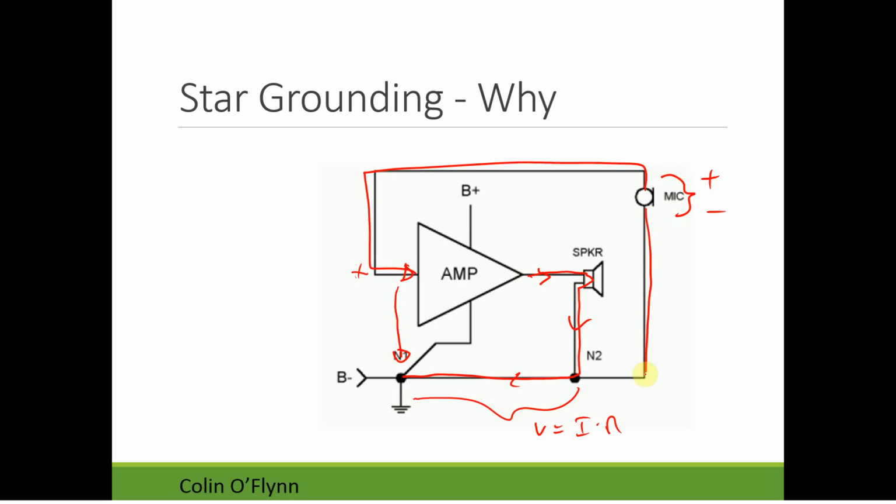So what this means is now when we look at our circuit, we were considering that we're reading the voltage across the microphone, but we're really reading the voltage difference between the input to the amplifier and that ground point. And so there's a small voltage difference between the ground point and the negative of the microphone. That's going to give us noise in the amplifier,